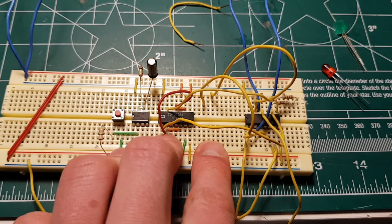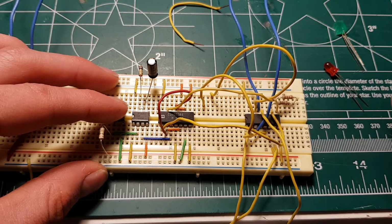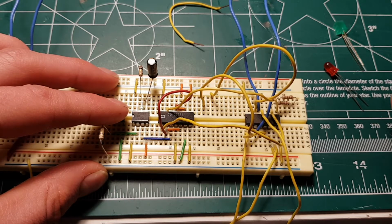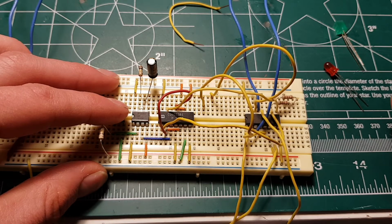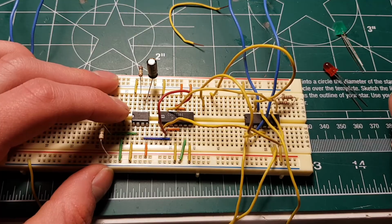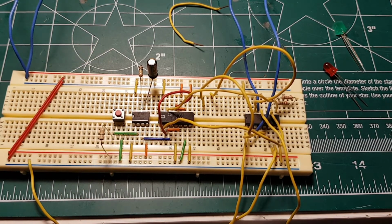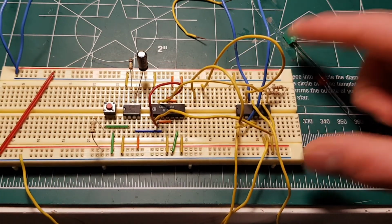So I'll do this. So you hear music now. Nothing, nothing, nothing. 2, 3, 4. Sometimes the switch bounces. Anyway, you get the idea. You can switch through 4 different sources with this thing. It's easier than trying to finagle a CD4066 chip to work in a similar situation; this chip is more designed for exactly this purpose.